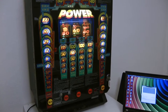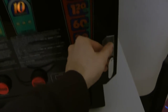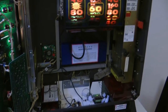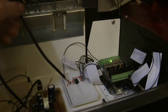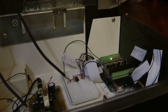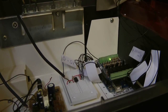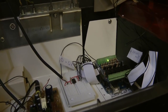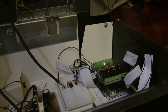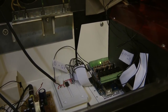On this laptop there's software running which simulates a DMX lighting console. Now let's open up the slot machine to see what we have built into it. The DMX cable from the backside goes into a breadboard, and the breadboard is connected over an RS-485 transceiver to an Arduino Uno. The Arduino Uno has an I/O board with some relays, and the relays are connected to open collector pins in the slot machine which control the action.